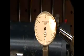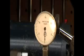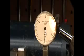You can see the finished crankshaft — the three crank discs which I showed you drilling on the lathe. It's back in the lathe now for checking. The central hole was drilled on the lathe and I moved it to the mill to drill the crank pin holes. I'm checking for concentricity and it's actually worked out very well. Using the dial test indicator, as I rotate you can see there's just over half a thou runout, and I'm sure that would be okay. I'm quite happy with it.